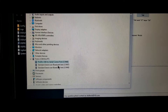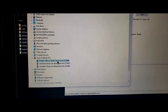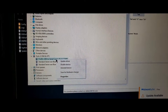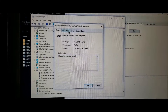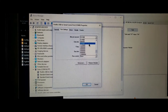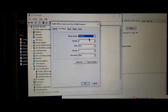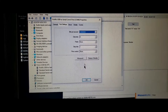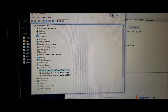The two ports below are what show up after you connect the device to the computer through Bluetooth — it opens up two ports over Bluetooth serial. We will open up these settings, go to Port Settings, and I choose to max out the speed of the port so we won't be limited on speed. It will use every speed below that just fine.